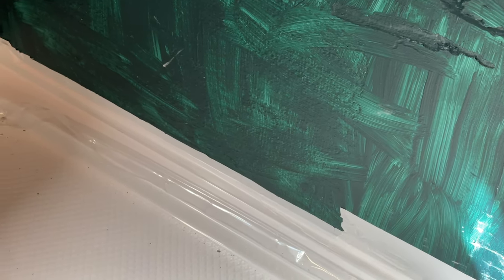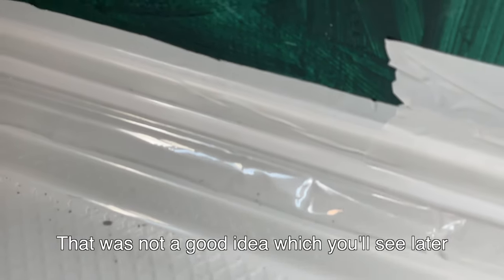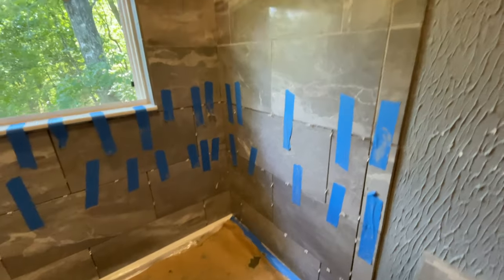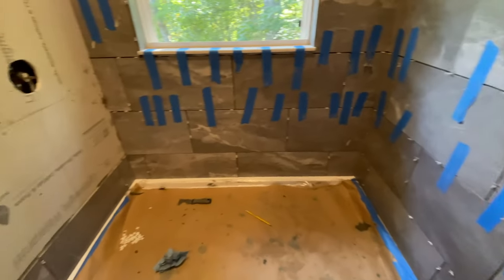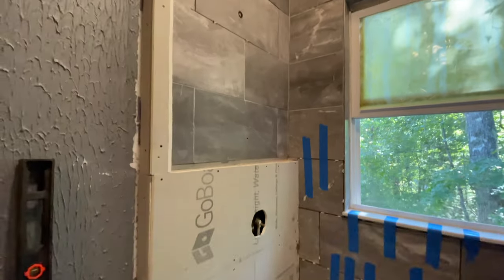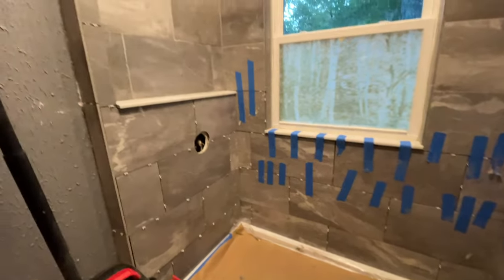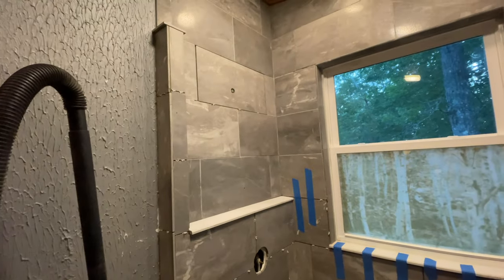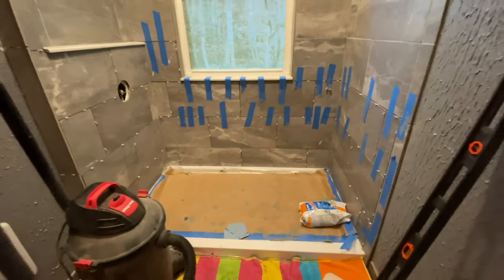I will put the tiles out in front of it - in other words, there'll be a lot of mortar there to build it out. So this is after I've got two walls done with the same tile. I didn't want to start from the bottom up - I probably should have done that, but instead I started from the top down and taped it in place so it wouldn't sag or fall. I also used little separators to have consistent grout lines, and that turned out really well.